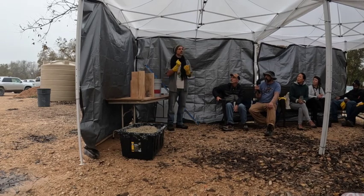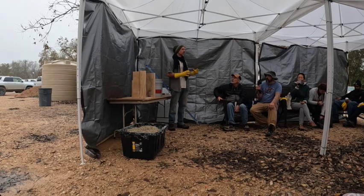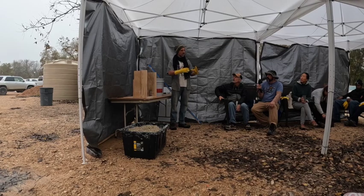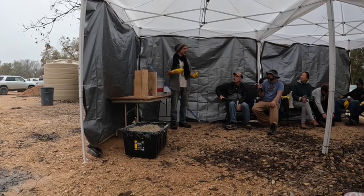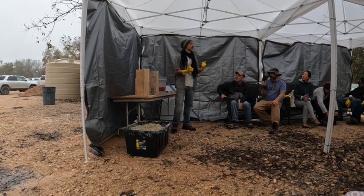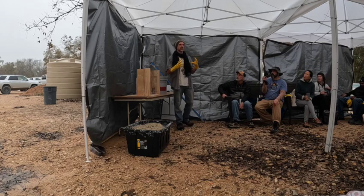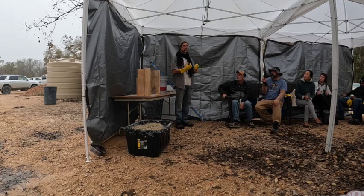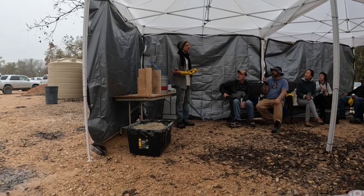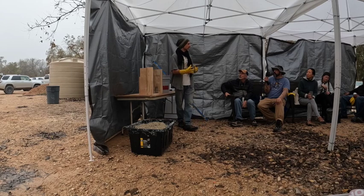Also, I've noticed when we do a lot of the block exercises, people are there for 10 minutes on this one little block, seeing how much they can compress into it. What I found is it doesn't cure very well, because you're making it so dense that the moisture really struggles to find its way out. So it's really important to be strategic with it.